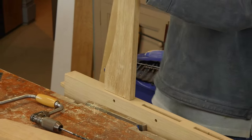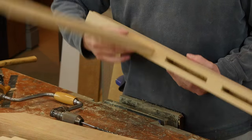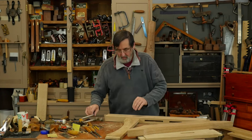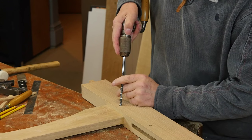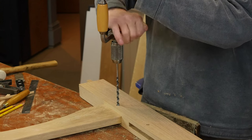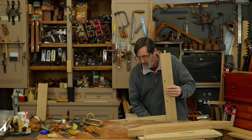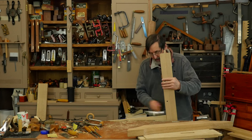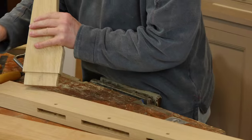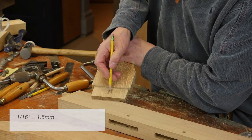I get this seated as much as I can, tight, to make sure there is no gap. That's as close as I've got — on both sides I've got that just fine. Now watch what happens here: I take the point of the bit and place it inside the hole, just pop it like that, and that's given me the very center of the hole. Then we take them apart. A lot of people think you simply bore through the whole thing — that's not the case at all.